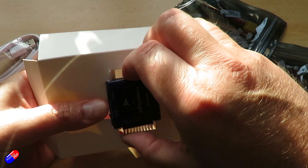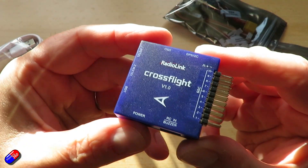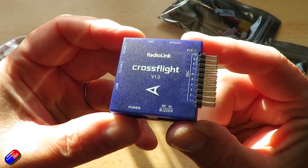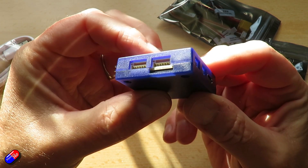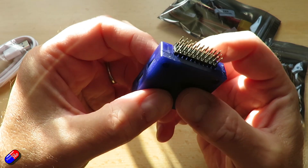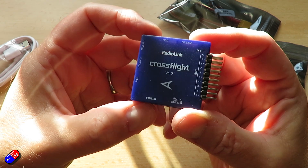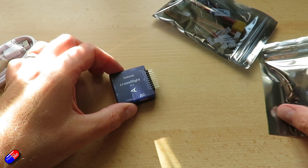It has 10 PWM outputs, two UARTs, and one USB-C port that you can plug into the computer. It has a GPS UART I2C port for your external compass and your GPS. If you buy the GPS that's designed for this, it just plugs right in. It will take PPM and SBUS as the input signal, and it has an OSD module integrated on here as well. Unfortunately it doesn't support D-shot or One-shot, but it does support things like NeoPixel LEDs and other stuff too.